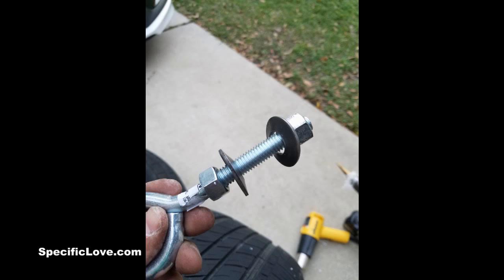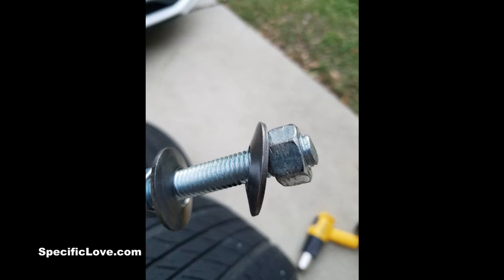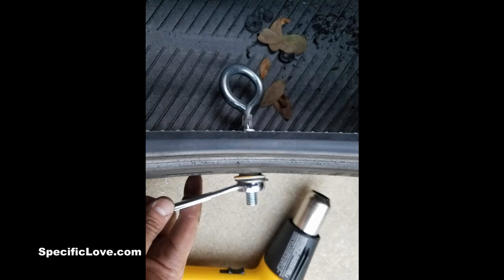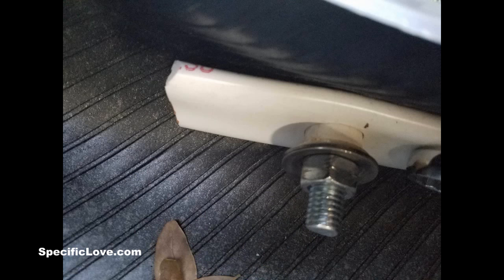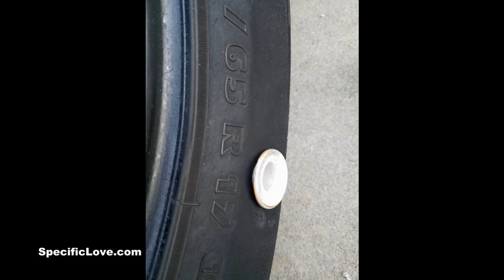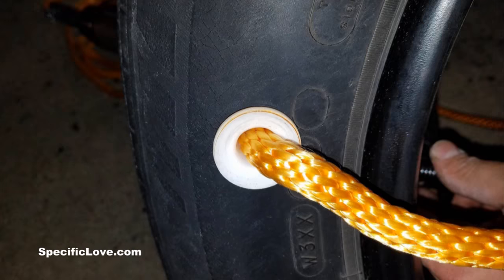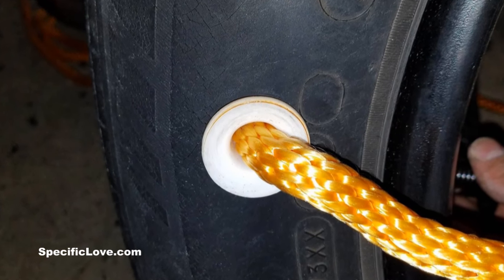He writes: I had to heat the pipe first, then use the box end of the wrench to flare it just a little — otherwise it would just squash instead of flange out. So after using the round part of the wrench to flare it a bit, I then added the bolt, nuts, and washers, heated it up and slowly cranked it down to make a flare to the right shape. That's a very cool idea, Chris — I never would have thought of that.